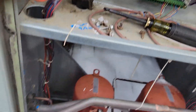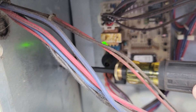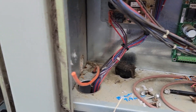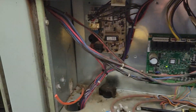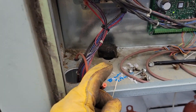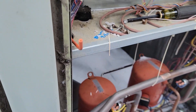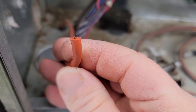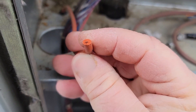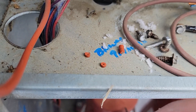Pull that ignition wire off — you can hear it arcing. We know the igniter is working, or the spark ignition is. Let's go ahead and trim that off a little bit. Lennox used to use a carbon fiber tip in here, kind of like a spark plug, and it would burn off on the end. They finally went back to a wire, but we trimmed off several different little pieces there.